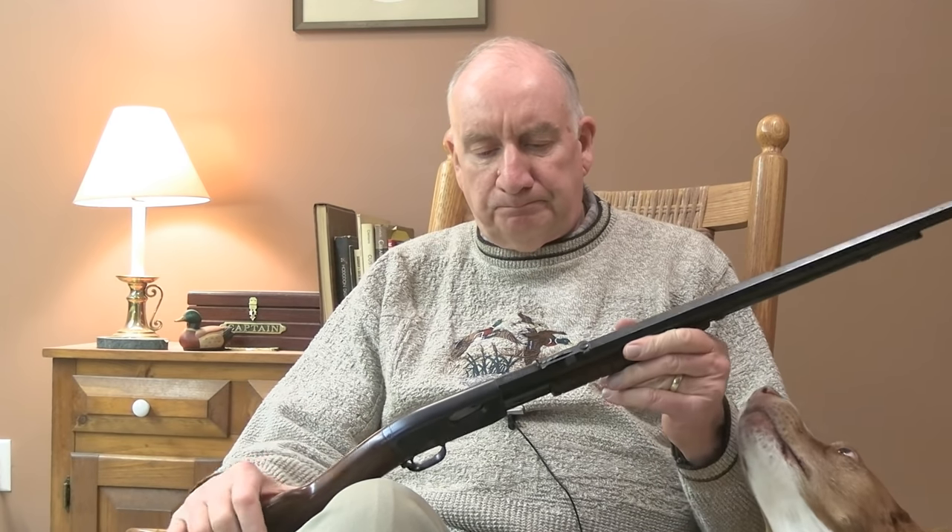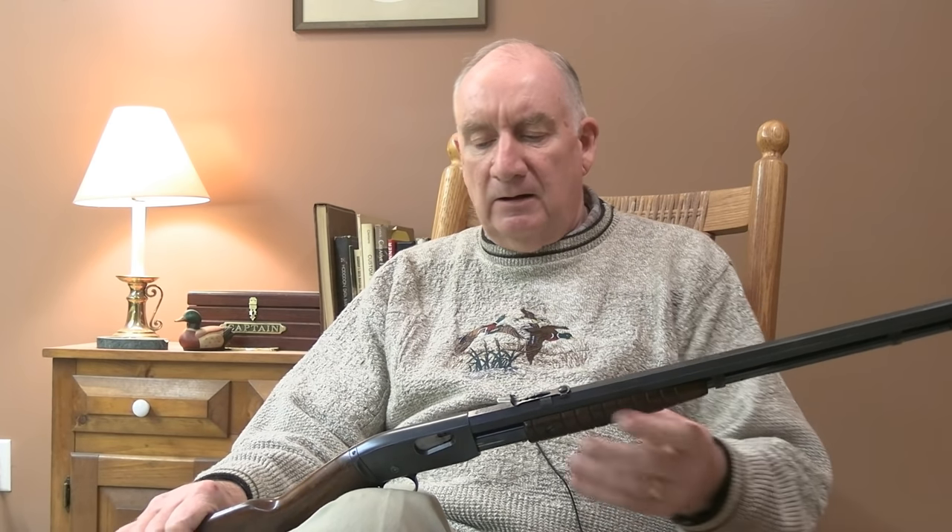Where was I? It would be an excellent gun to have sleeved — the barrel would be bored out and a liner silver-soldered in place. It is a nuisance to have every now and then empties get hung up in the chamber, and then it double-feeds — a new round trying to go into a chamber occupied by a spent case. So that's it.